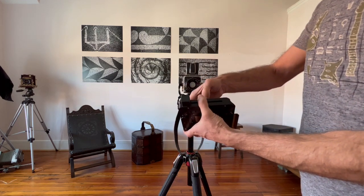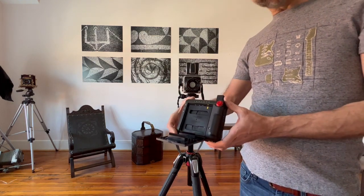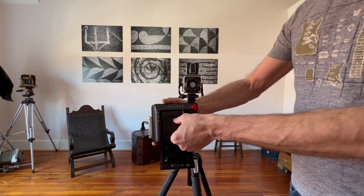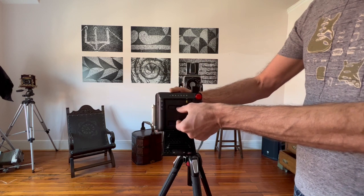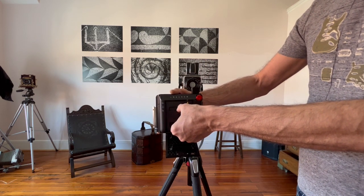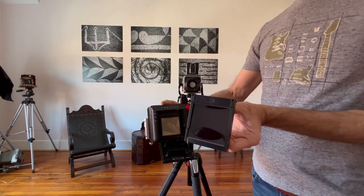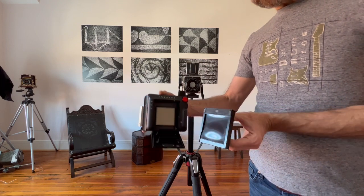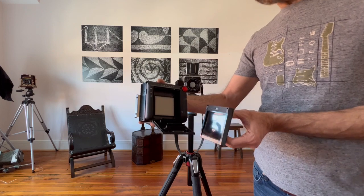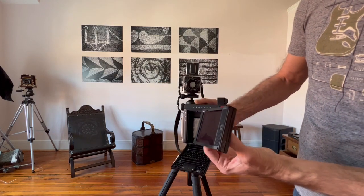Anyway, so let's open the back. What I have inside is a cartridge with used film. I'm using this for testing, and I'm also going to demonstrate the way you take out the cartridge. When you take it out, don't tilt it, just take it out perpendicularly, like that. And you're going to see the film. When you insert a new cartridge, you're not going to see film here, you're going to see the little plastic film dark slide. And then you can see the inside of the back, you see the fiber optic plate